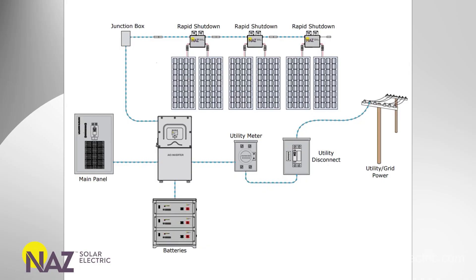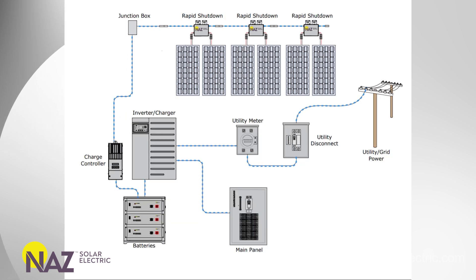Traditionally we use two types: DC coupled PV and AC coupled PV. DC coupled PV is a technique where we have strings of solar panels in series and tie them directly into an AIO inverter — like an all-in-one inverter — or directly into a DC coupled ESS system. DC coupled systems have been the go-to method of power delivery for most AIO inverters and ESS systems, and this technique has long been used in PV string inverters.